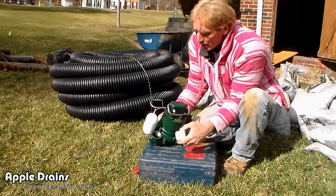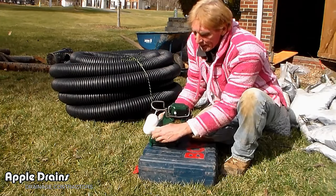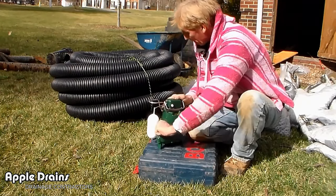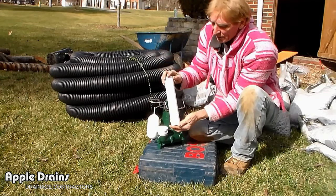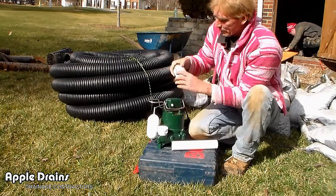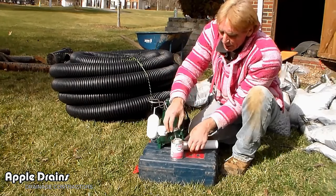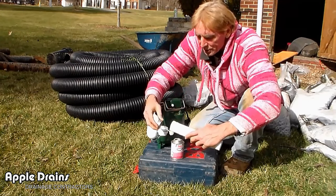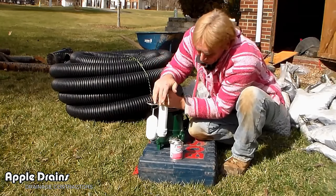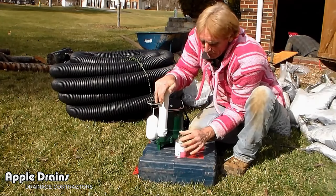Let's review for setting up the second pump. You've got a male threaded inch-and-a-half adapter that goes right into this spot here, threaded. This is a female inch-and-a-half. This is cast iron to PVC — just get this on hand tight right now. Next, we've cut a piece of inch-and-a-half PVC, going just above the bar. We're using Oatey all-purpose medium set cement. Once you put this in, it welds together — a permanent bond — so we push and hold for just a second.